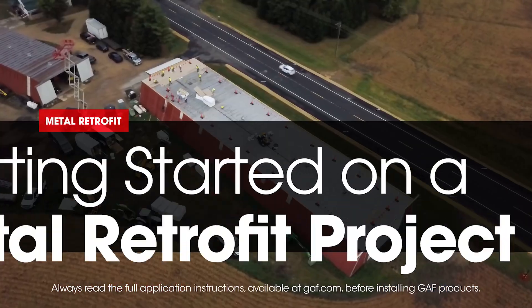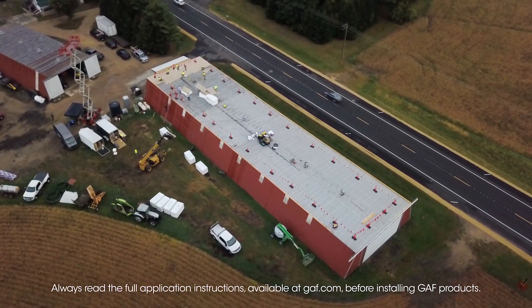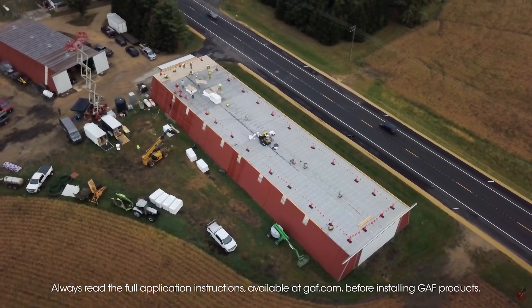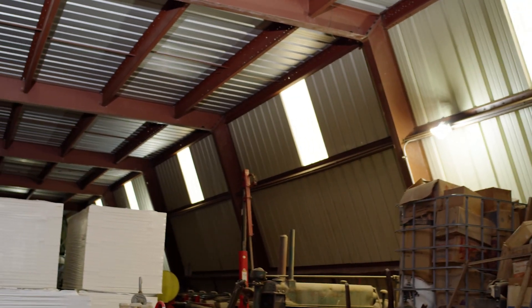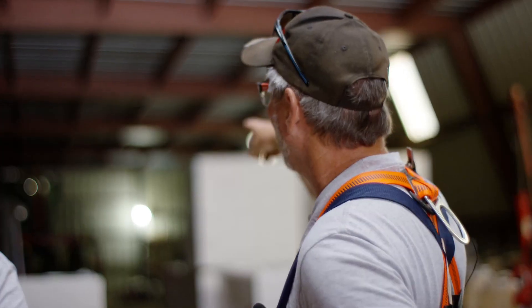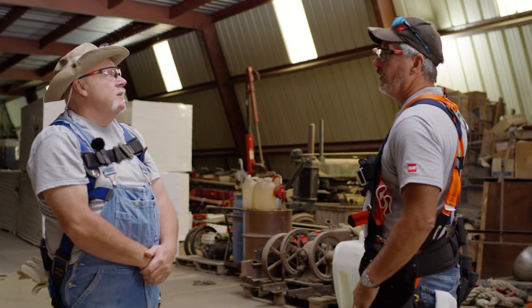You can see we got some work going on in the background here, so we're going to talk about what you basically got to do to start this job. What do you got to do anytime before you go into any building like this? You come inside and look for skylights, because who knows, you might not be able to see them from the top. On this one you couldn't, because of the coating out there. We actually walked it and didn't see anything — they have the actual skylights in the wall.